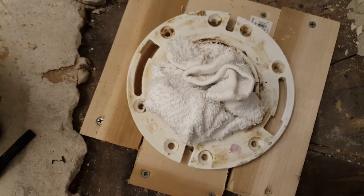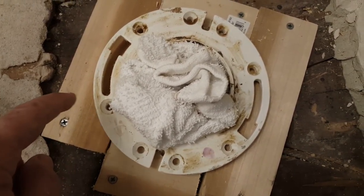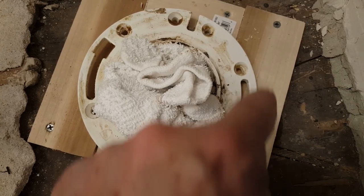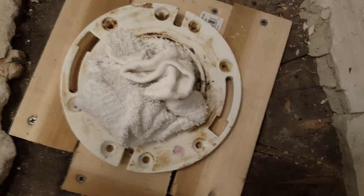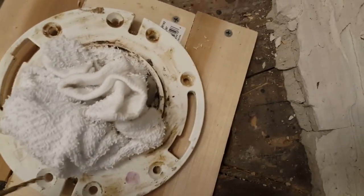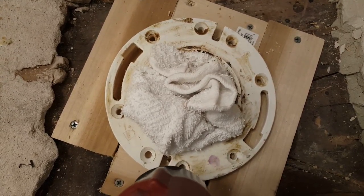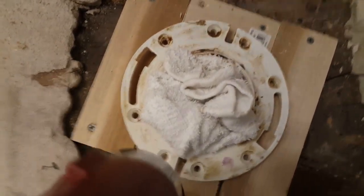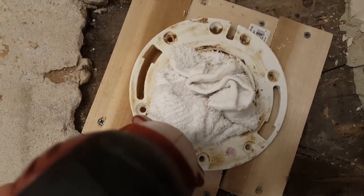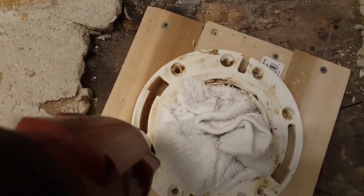Keep in mind this is wood, and we now have a possibility of eight different places to put screws. We've opened up our choices, but we need to pre-drill to make sure we get perfect holes in this wood so it doesn't split after you've already tiled over it. We're going to go through each and every one of these holes and pre-drill, like this. I'm a big fan of pre-drilling because I don't like splitting wood.